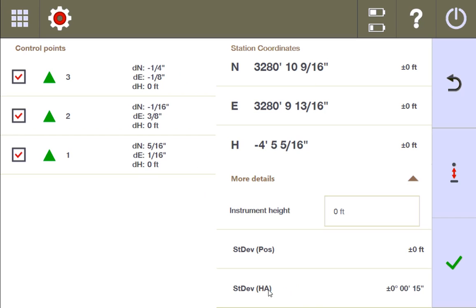The horizontal angle will be better when you have three points that you're using, and might not be nearly as good if you only use two points — that's talking about how accurate your horizontal angle measurements are going to be. Watch how my angle significantly improves as I change these control points. Here it's 7 minutes, 40 seconds of an angle. With three control points, I stay at 15 seconds. I try to keep it around 15 seconds of angle for my standard deviation of horizontal angle to improve my accuracies on all measurements. When I use three points, it's almost always better than when using two points.